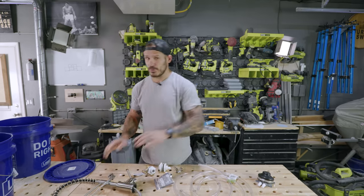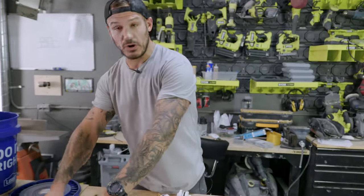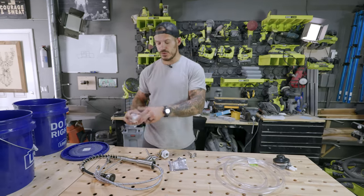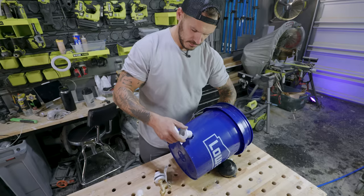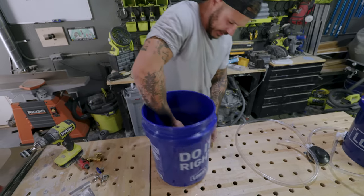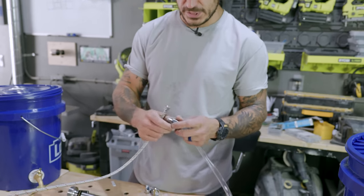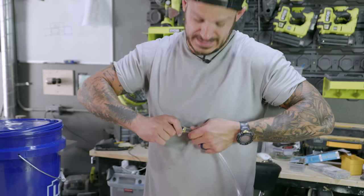Let's figure out this plumbing situation. We don't have direct water coming in, so we're going to have to improvise to make this kind of like an RV-style thing. We have our faucet from Amazon — it's got a three-eighths inch connection. The solution I'm going with is a classic traditional foot pump that you'll see at a port-a-potty to wash your hands. Half-inch clear hose, a couple of fittings — one to tap into the bucket below to feed water into the pump, and one to tap into the bucket to drain the soiled water. This is a three-eighths compression connection — a traditional PEX connection doesn't work. The next solution is using a SharkBite, which slides on like PEX but has a better connection, so hopefully it won't start leaking.